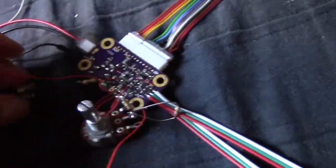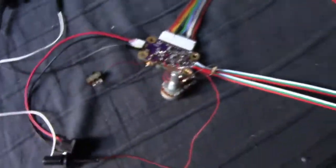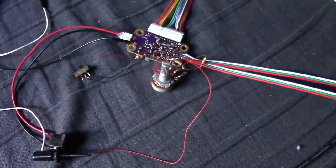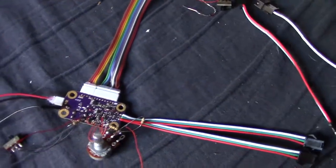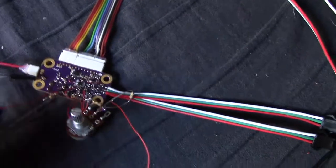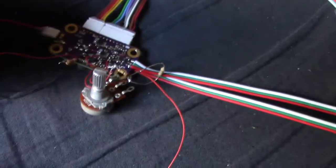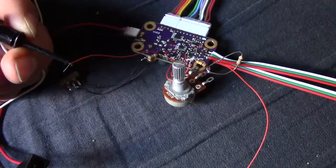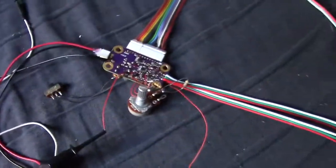Now, when I'm just using my little flip-flop circuit, I have a problem because all the power is being stored in that capacitor for that really long time. When you're seeing that really slow slope on the oscilloscope, it's because there's a lot of voltage left in that capacitor. And maybe we can actually look at that. So I did wire up a lead here. So part of it is actually a problem of too much voltage floating in the load upon power down.